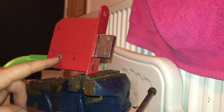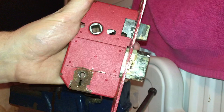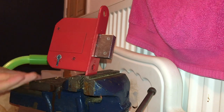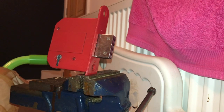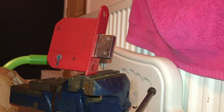So yeah, really, really important. I ID locks — normally, first is by the gauge: 5-gauge, 7-gauge, 8-gauge, 5.5-gauge, whatever. Then by color. And if you can't do it by color — like for instance this one, if you look through the keyhole it'll just look brown — take the handle off, move back a little bit, and you're always going to get the color of the lock. Then I go for distinguishing features like hard plate. You've got mortise ID books which will help you identify locks, but you need to be 100% before you drill — absolutely 100%.